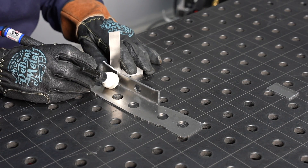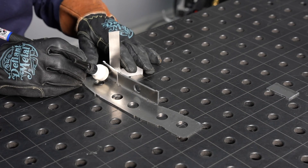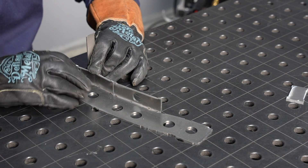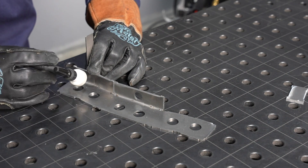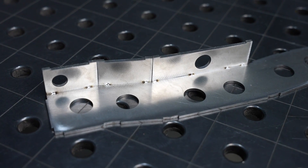The first thing — and this is my favorite advanced feature so far, the most useful and productive — is fast tack. I'm not controlling the amperage with my foot pedal; I have it set to a profile. You may be able to hear a pulse that happens, and it's a specially engineered pulse that draws the metal together.